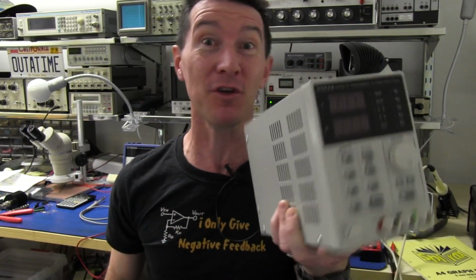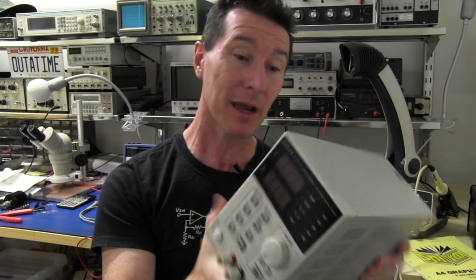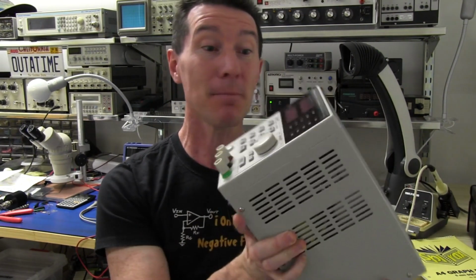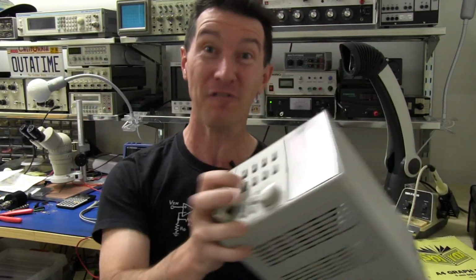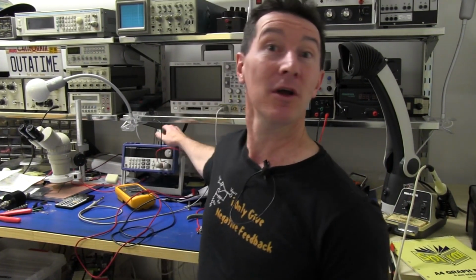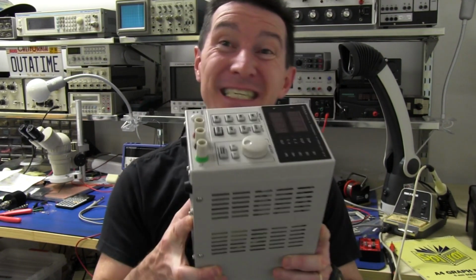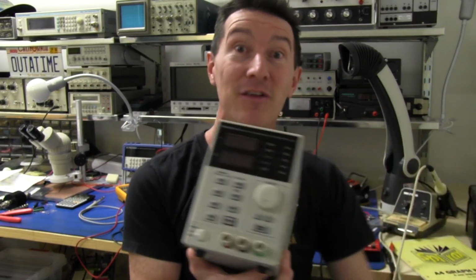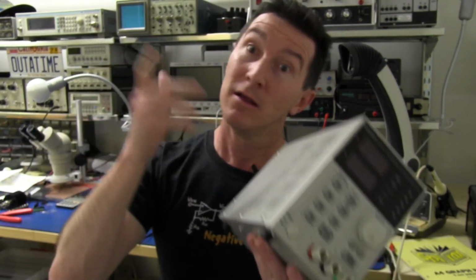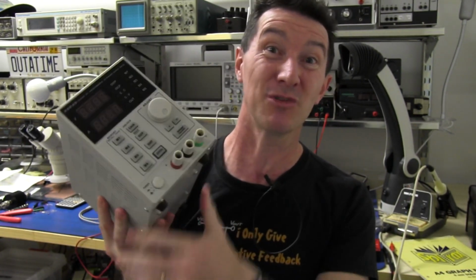I've killed it. The EEVblog review curse strikes again. Now, this is unbelievable, the fact that I've done something to it. I'm going to have to open it up and have a look at it, but it's completely died. And not just not giving any output, it's giving output over and above what you set it, even when you turn the thing off. It's ridiculous. And it doesn't matter what I do with this load here. I can short this thing out until the cows come home. A good power supply, you shouldn't be able to kill it. It's ridiculous. Not if it's just going to die when I'm just playing around with an electronic load like this. It should be able to survive dead shorts on the output, because that's what all the current limiting and everything's for. Unbelievable. Loser. I'll keep you up to date with what happens with this thing. Maybe we'll try and investigate it somehow, but hey, sorry Charles, I killed your power supply. You want it back?